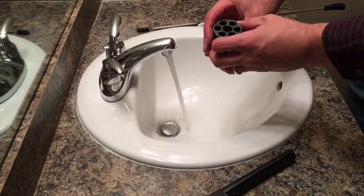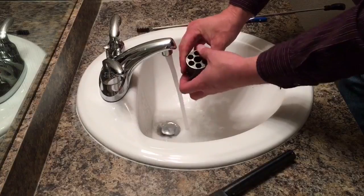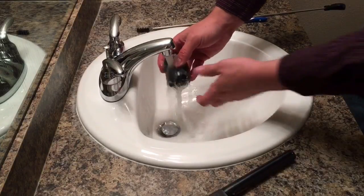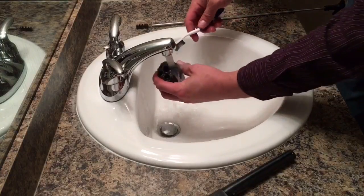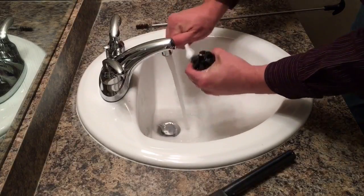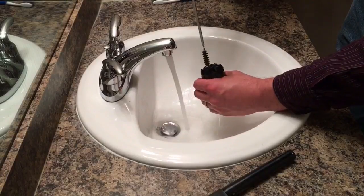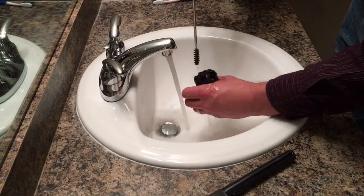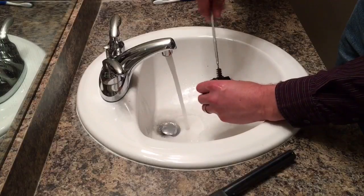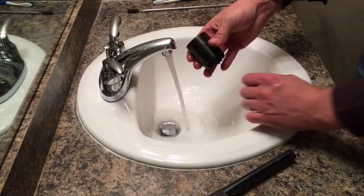With the cylinder, I'm going to run the hot water through all the chambers starting from the front — you can see all that fouling just fall right out and melt off. If you're shooting Pyrodex or some of the other substitutes it might be a little dirtier, but black powder is very easy to get off. I'll take a toothbrush to the back of the cylinder to get all the little nooks and crannies, then run my cleaning brush down into the openings where the nipples go — not into the threads, just the openings — to help reach those hard-to-clean areas. And that's all six chambers done.